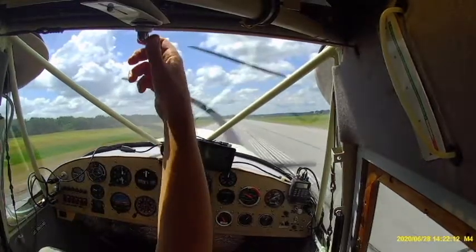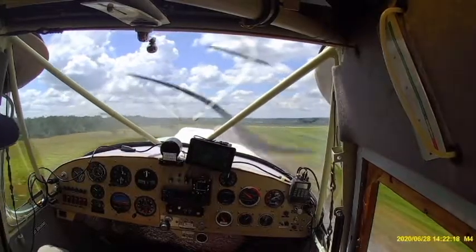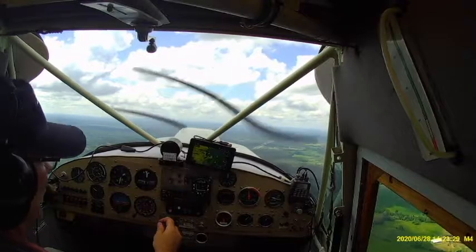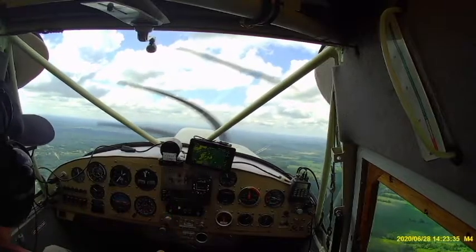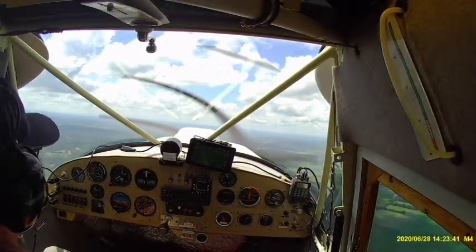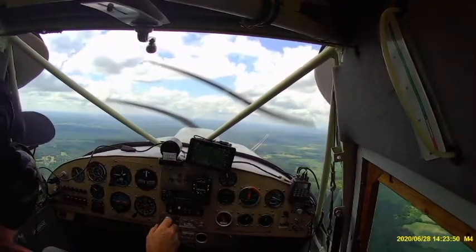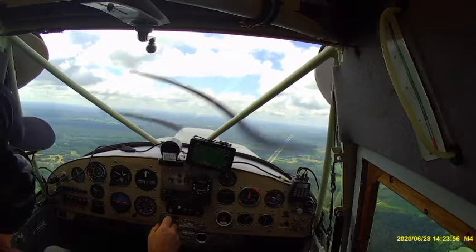This is repetitive, but that's what it takes. Complete the same test flight profile, straight ahead, straight out climb to 2,000 feet, full throttle to circuit height, then reduce the manifold pressure to about 27 inches for the sustained climb up to 2,000. So the louvers are open, but the cowl mod has been made. And you can already see that the temperature here is higher than it's been for any of the other conditions.